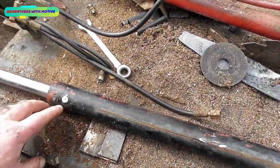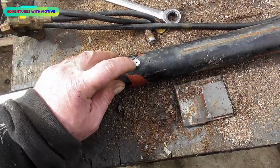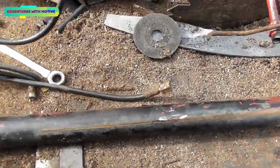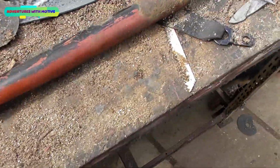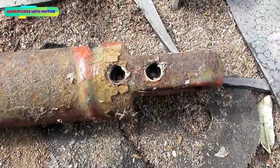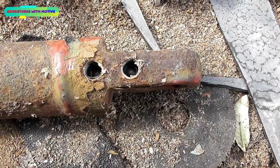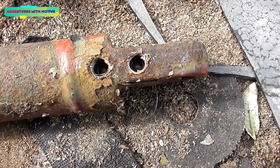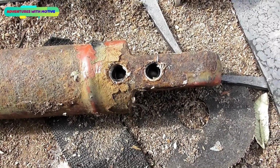Now, I'm going to make an assumption that you could get away with literally drilling them both out and repiping it. It might be enough, but I suspect it isn't, because you've still got a similar issue there. You've got two filters in there, and that is another problem. Behind those filters is smaller diameter holes again, which I'll show you in a minute when I pop those out.